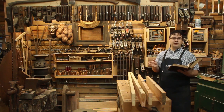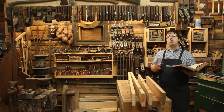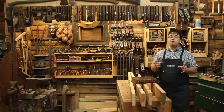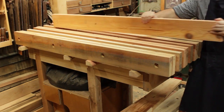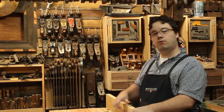There's mortises for the legs. There's going to be some dog holes in ours. Roubo would have needed an army of Oompa Loompas to chop all those mortises. But with some careful planning, we can avoid all that work. I've got 14 plain 2x6s cut to 5 feet long. So let's lay out our holes.